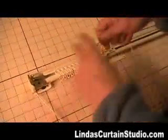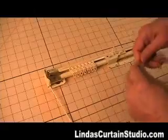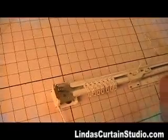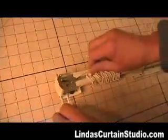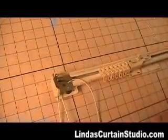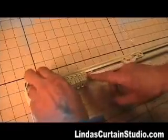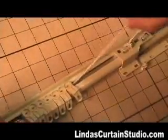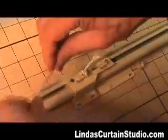Get the other end of your cord. Feed it between the 2 pulleys, and feed it through. Pull enough slack so you have some cord to work with. Again, place it under your slides and bring it all the way through. This time, go under the master carrier, bypassing it.